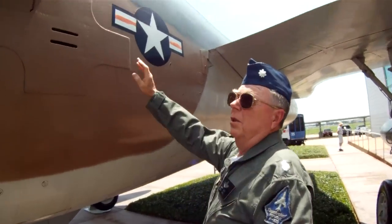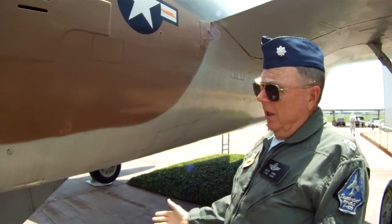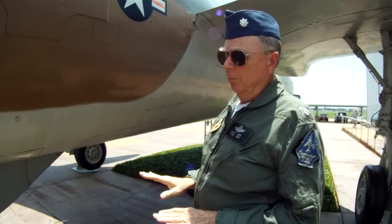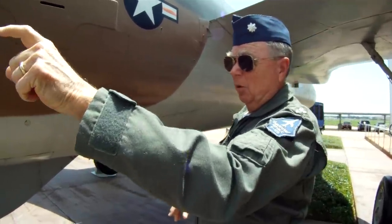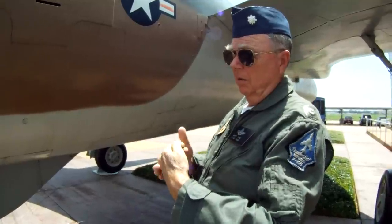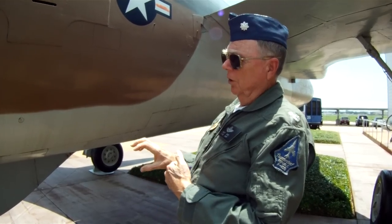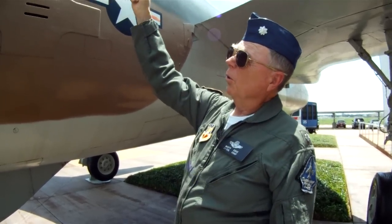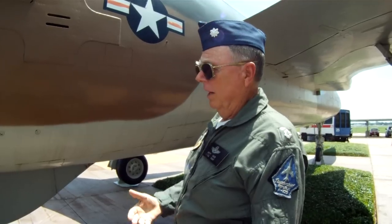We call these the dog ears. At one time they changed the operating procedure on the airplane, which caused other problems. At certain airspeeds it would vent fuel out the vent and suck it back up between the outside of the liner and the engine itself. Under certain conditions it would explode — which is a bad thing. So to fix that, they bled air from the engine again and used it to force air through here and out the back end, so there was always a constant flow of air going through there instead of having the air stagnate.